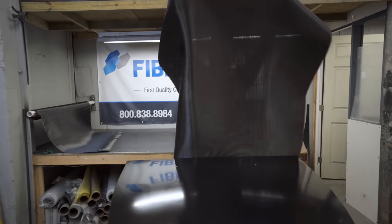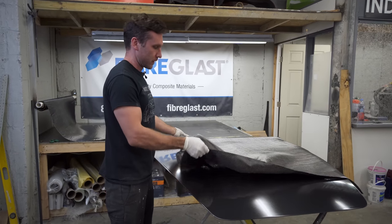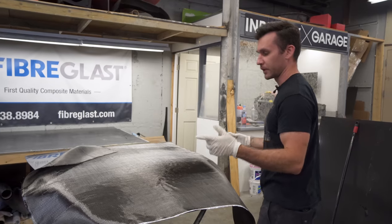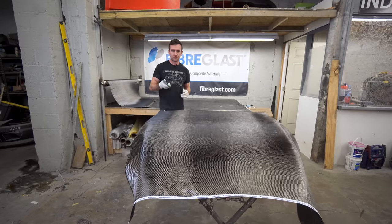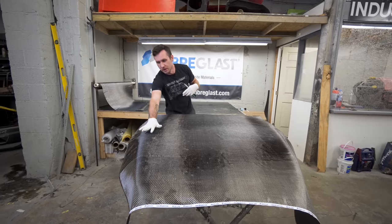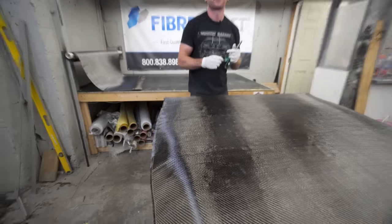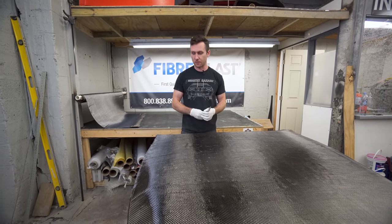We've got our carbon cut. We're going to go ahead and just lay this on there dry first. The nice thing about laying it dry is you don't have to worry — if it was wet and you don't get it perfectly set on the first layup, you can run into problems where you have to pull it back up and pull off your PVA release film. Actually, I'm going to wet it out first and then trim the edge. You don't want to let the edge of the carbon sit too far over your part because it'll droop and raise up at the edge, creating a big air pocket. So you want to cut as close to it as you can.